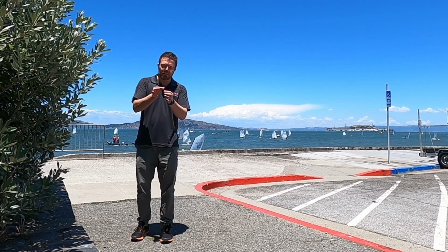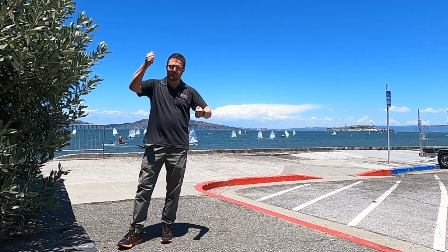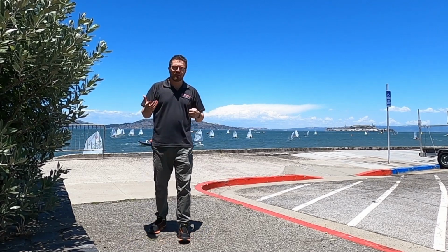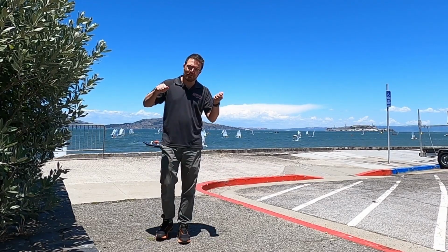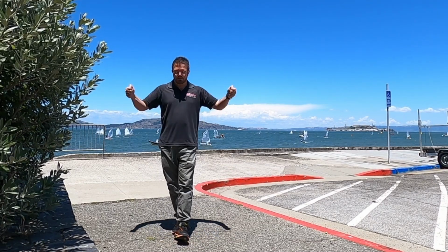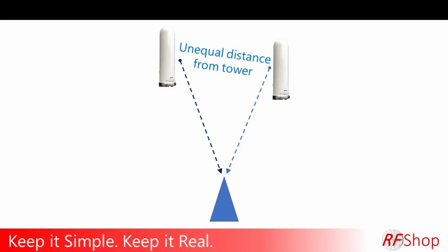You can control that. You can now go higher. So you have two antennas, rather than just going like this, you can also go up and down a little bit. So now you have two levels of spatial diversity that you can play with. Don't take an Omni antenna, and I'll make a separate video on that in a few days time as well. Don't turn the Omni by 45 degrees, because you're going to muck up the whole working of the Omni by itself. So let's not do that. Let's just take an Omni antenna, two separate Omni antennas, space them, one higher than the other one. You have quite a good diversity system going.